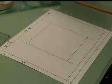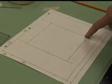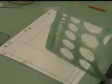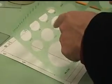Now what we're looking for in this instance is, it says that our big circles here are a 5/8 radius that goes around these parts. So a 5/8 radius, 5/8 plus 5/8 is 10/8. 10/8 is 1 2/8. 1 2/8 is a 1 1/4 inch diameter again.